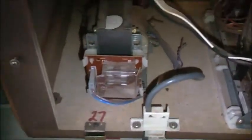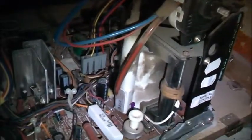I think, judging by the thickness of those windings, you'd probably get about 4 or 5 amps out of it. The current's not enough for a ZVS, but you've got bloody plenty of volts for an IGBT circuit. 115 volts is bloody epic, but not enough current, so I'm going to keep this TV in one piece. Alright, let's measure that flyback, just to see how big it is.